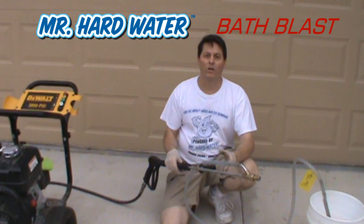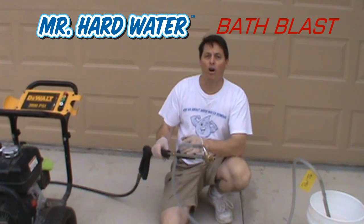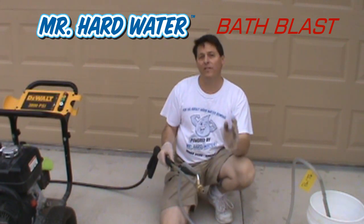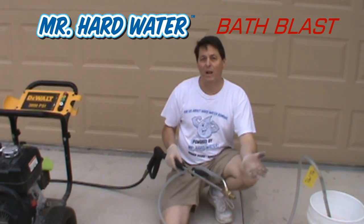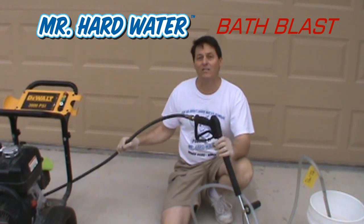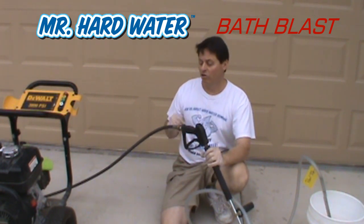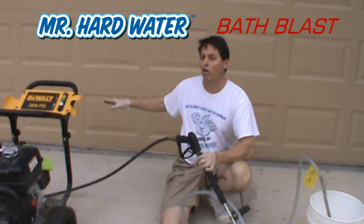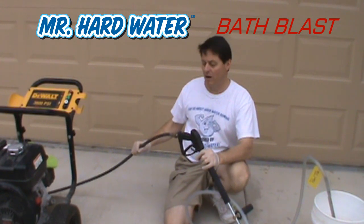If you're working indoors on a shower, one thing you can do to increase performance and keep the job cleaner is to shorten the draw tube going to the media. Each system ships with 20 feet of hose, but a lot of times I'll cut the hose in half and only use about 10 feet or less so the media stays close while blasting. Also be aware that when working inside the home you really don't want to use the black inlet hose because it can leave black scuff marks on surfaces — it's better to use the blue hose. In this case I'm leaving the pressure washer outside, running the hose to the garage, and I've only got a few feet into the shower so managing the black hose is easy.